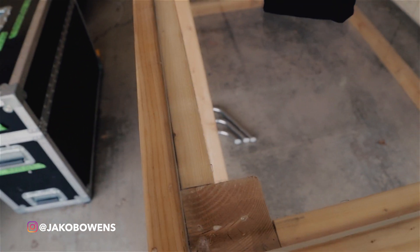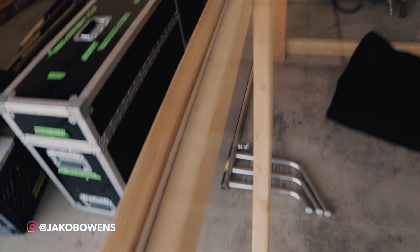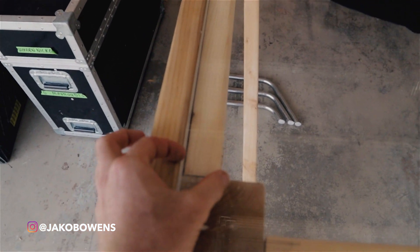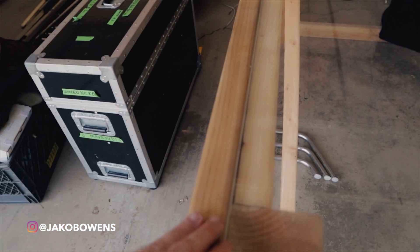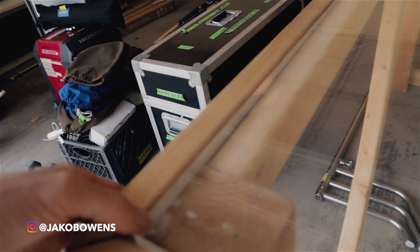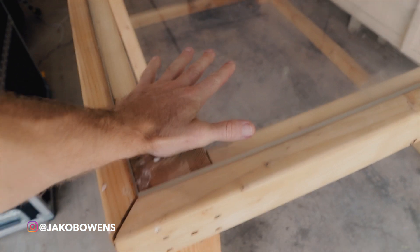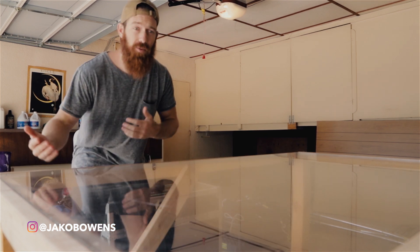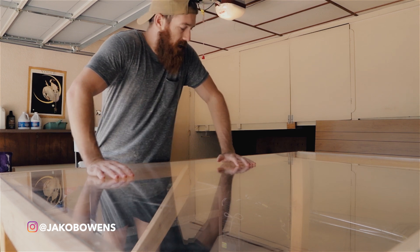Here's a look at the plexiglass platform. It's basically a couple of two-by-fours built into a rectangle frame to fit the plexiglass. It's an inch thick, and we built the frame so there's about an inch-to-inch-and-a-half lip — that's what the glass is actually sitting on all the way through. You don't want the glass to just rest on top where it can slide around; you want it to drop down about an inch and sit in so it's about an inch wide. That way if someone's on it moving around, it's not sliding. The plexiglass is literally just sitting in that lip — I can lift it up and take it out, but it sits right down in there.